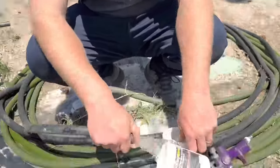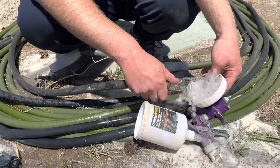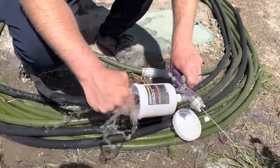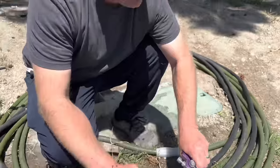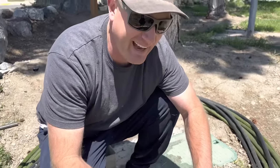Seb, you want to give them some pointers on how to clean your gun? Yeah, about once a month — if I'm using them a lot, I'll take them all the way apart and clean them out. But mostly I just run a lot of water through them, rinse them off right after I use it. I'll put a whole thing of water in here, spray it through the gun with just straight water, and that cleans most of your inside parts up pretty good. You can do that a couple times — just straight up water, no chemicals. I just got the nozzle right in where the water goes in the inlet and I'm spraying it straight through; don't even need any air pressure. Or I've done it too much and I'm lazy and I don't like to take my gun apart.